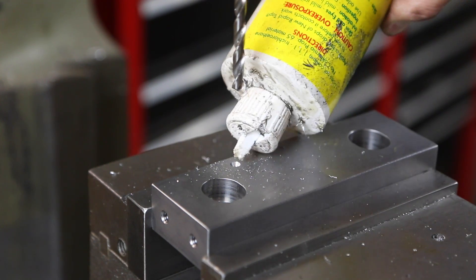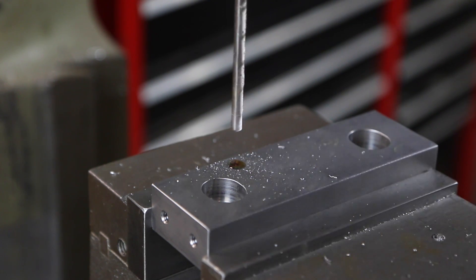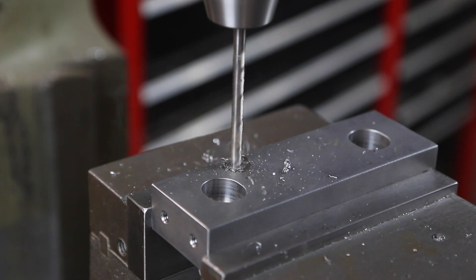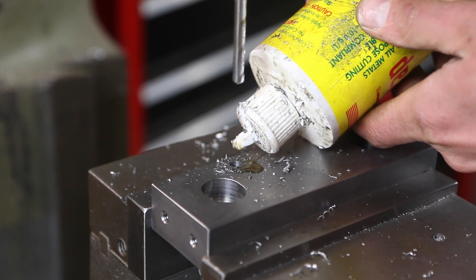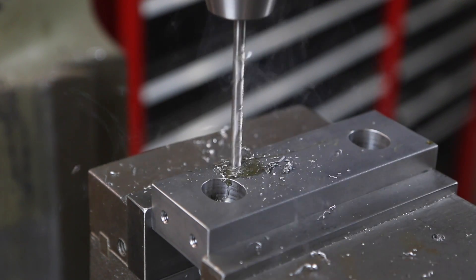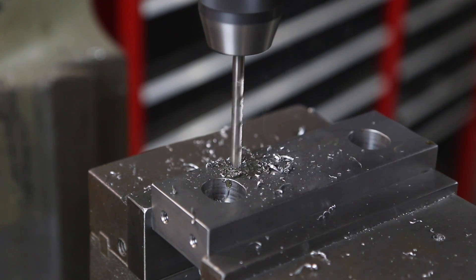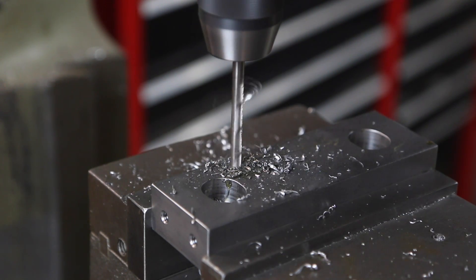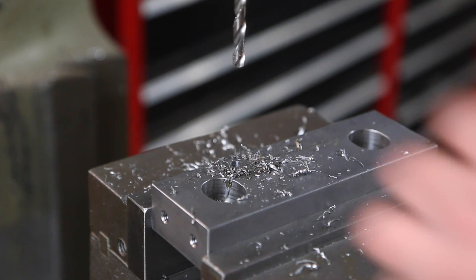Camera rolling. A little dab of — I call it coolant even though it's really cutting fluid, that's okay. Now I'm going to drill all the way through this because if we don't and you try to push a dowel pin into a good reamed hole, the air pocket is actually going to want to push that pin out. You could create just a little bleed hole, but I'm okay going all the way through. All the way through — off.